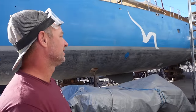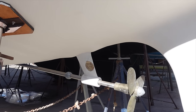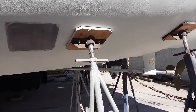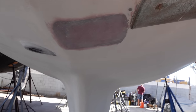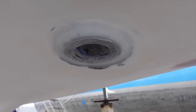That was the patch we missed. And then this one had some water coming out of it, so I opened it back up and I'll try it again — that's the only little bit that we've had seep. He's also adding an anode on the strut because we had a little bit of electrolysis problem. These are the stands holding our boat in place on the hard stand. When we painted it was here and now he's moved it over here so we can paint this part. He filled a hole — there was another hole in there for the transducer, now we've only got one. That was a timber backing that was all rotten, and he's replaced it with G10.